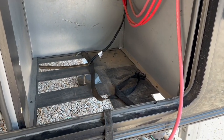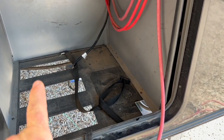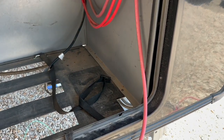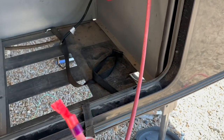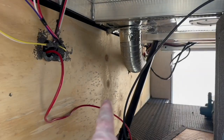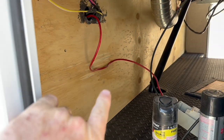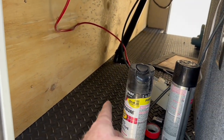Partway through day one — we've found everything we need, taken the inverter cables out, and the batteries are gone. We're going to build a platform to put the two 24-volt batteries in and figure out a plate system to go over the top to house his single 12-volt battery. This would be the 12-volt side. We've taken out the inverter, which was right here. The transfer switch was over there and is now mounted up on the ceiling. We've already prepped this area, now we're going to paint it. Everything is going to be mounted on this board.